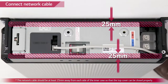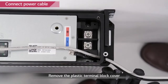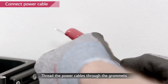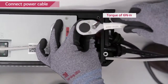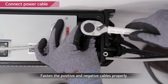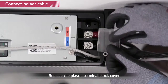To prevent the top cover from pressuring the cable, it must be kept 25 mm from the inner case. Remove the plastic cover of the power terminal block. Thread the power cable through the grommet and then through the large two holes. Connect the cable to the port and tighten the screw with a torque of 6 Nm. Keep attention not to confuse the polarity — the right one is plus and the left one is minus, as marked above the terminal port.